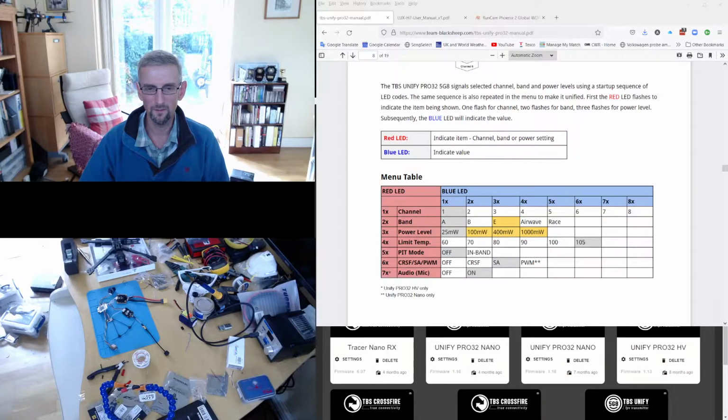And then quite satisfyingly, what actually happens is you power it on and it switches mode, power off, power on again, it switches mode, so it doesn't just keep flip-flopping back while you're watching. It does a switch on, power on, and then powers off. So if you're really confident, what you can do is short it, power on, power off, and you should be done at that point if you only do it once, and you wouldn't have to look at the VTX or anything like that.